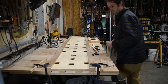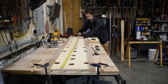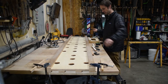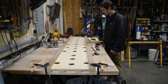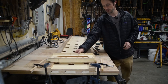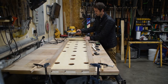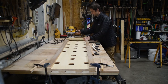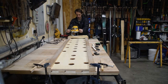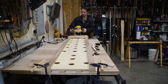This is a piece of masonite. The whole jig is seven feet long. All these are pieces of three-quarter inch ply — I do believe I built the whole thing out of one sheet of plywood. And this is the sled. It rolls up and down on the rails. The router sits on top; you can go side to side on it. Usually I just kind of leave it in one spot, then use the other rails, move it over, go back up, move it over, come back down, and profile away.